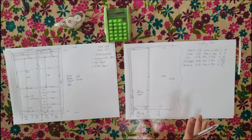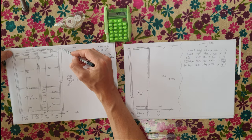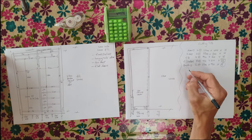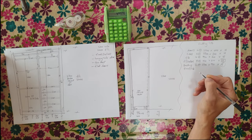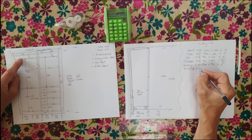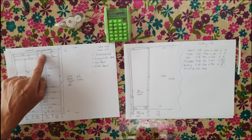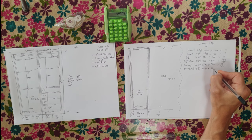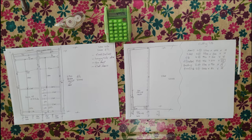Okay, so we've got everything we need, barring the trims. Trims wise, I always fit my top and bottom trims in first, wall to wall and skirting to skirting. So I'm going to leave them long, so I'm going to go trims, top, bottom. I'm going to go 2 at 2440, which is a rip of MDF. We've got 850mm height and 50mm. I'm just going to go a little bit extra and go, okay, let's go 80 so we can scribe it. And that's going to be an 18mm trim.